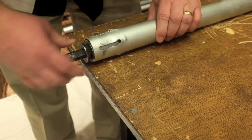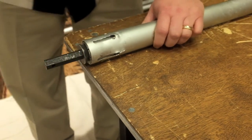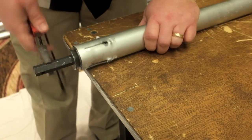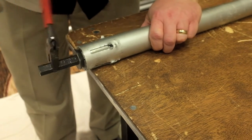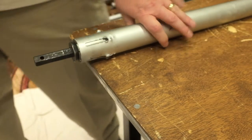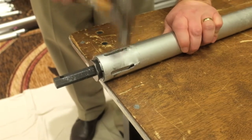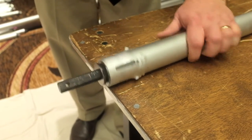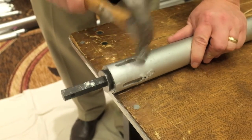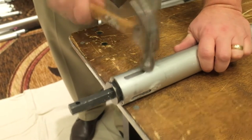For the pipes that are not so damaged and that can be repaired, we're going to use a simple pipe expander. We're going to insert that into the tube. Tighten it up just a little bit — not too much, you don't want to expand the tube at all. Now we're going to take a small hammer and we're just going to hammer in all of the burrs and shards that are sticking out from the damaged areas, and basically re-round the pipe.